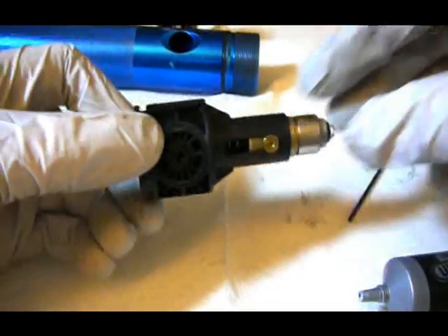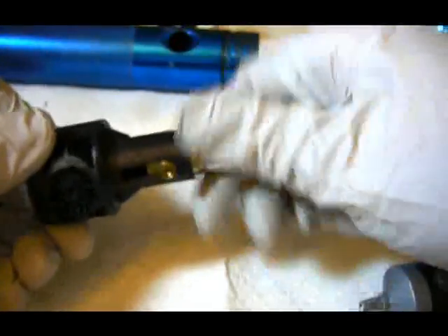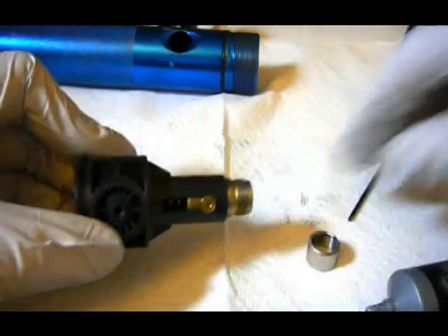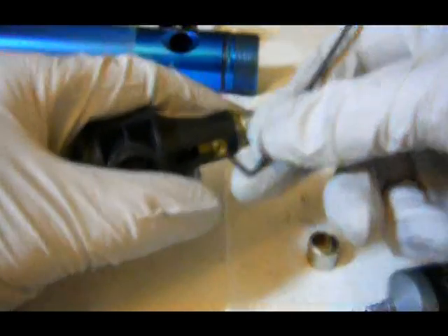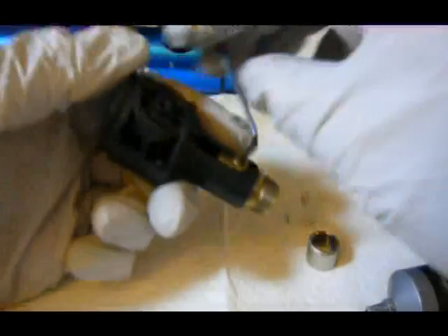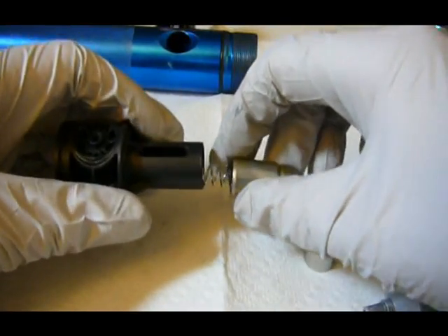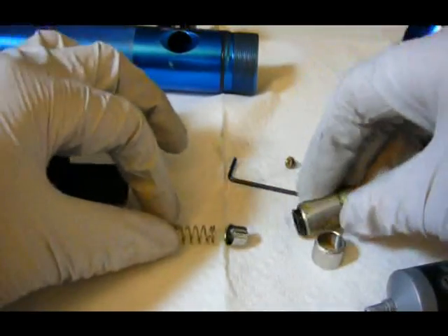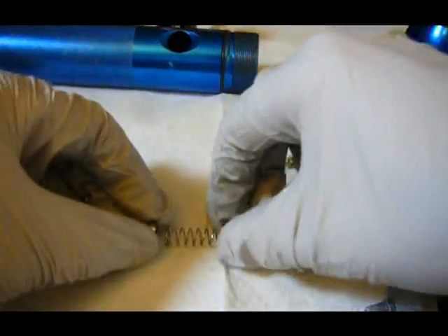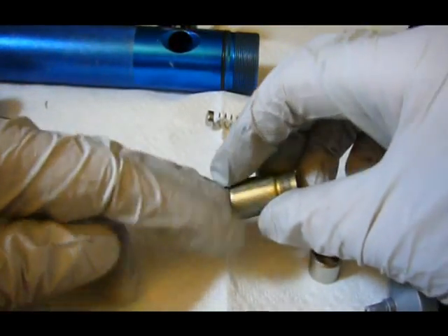So this is the lamp holder and switch assembly right here. What I'm going to do is take out the lamp — it's an LED lamp, so it's a lot better than the ones that come with it — and set that aside. I'm going to take the same 5/64 inch Allen wrench and use that to take this Allen screw out. Now I'm going to take out this lamp holder assembly, which is a spring and then two caps on the spring, and those go into the back of the lamp holder.